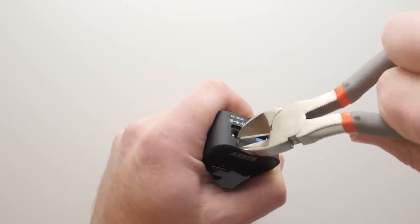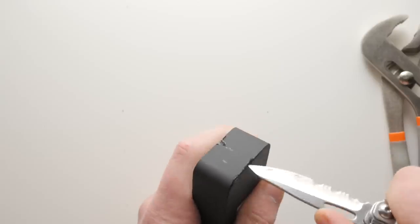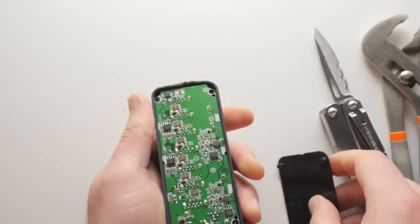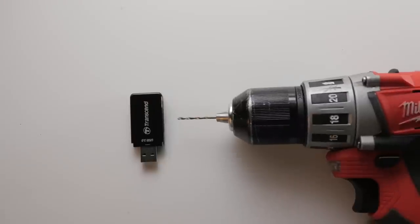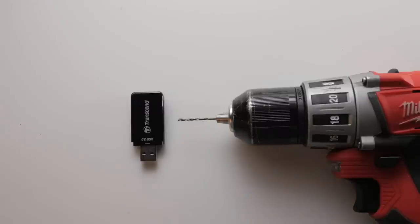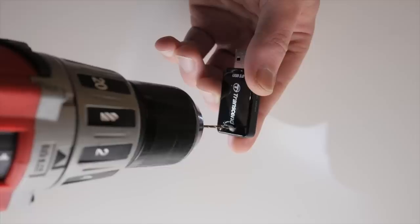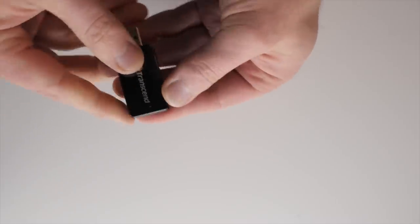Now we're going to talk about making the editing hub Mark I. First thing I did was take off the enclosure wrapped around the USB hub — it's a bit risky, but I wanted the extra space and really good access to those LED lights so I could reroute them. I used a wire cutter, a Leatherman knife, and a pair of pliers. The back popped off and I removed the actual top of the hub. Next, I took my USB 3 card readers and drilled a small hole right where the LED is so I could stick a fiber optic rod through and reroute the light. To figure out where to drill, I plugged it into the hub, and once it lit up with a card in it, I marked where to drill and then very carefully drilled the hole — using the hand holding the card reader to control how much I was drilling through, so as not to punch through and damage it.